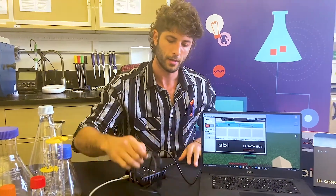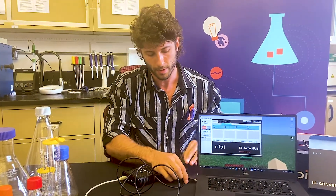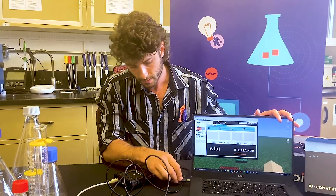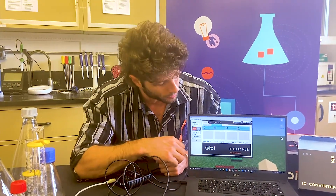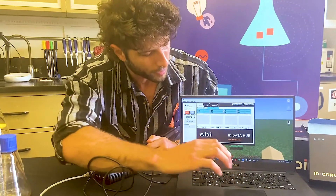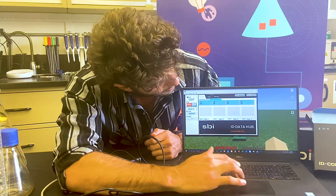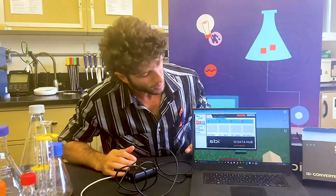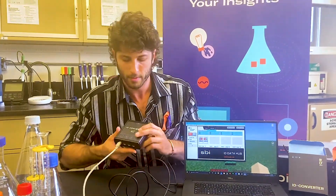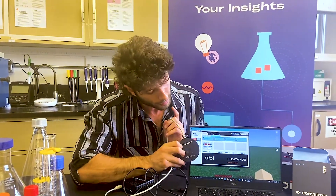The other side of the USB cable — just a standard USB port — plugs into the computer just like this. When that happens, the software will make a little sound and then it will recognize the ID reader after we click the Test Readers button. Because we plugged into port one on the ID converter, station one on the software now populates, and that's representing this ID reader right here with these two buttons.